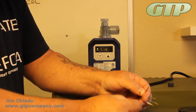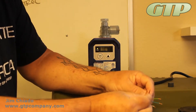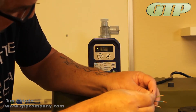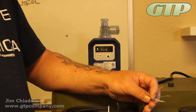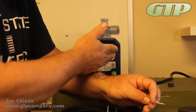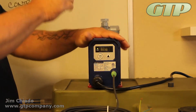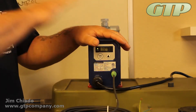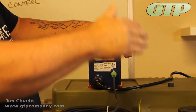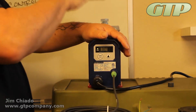The brown and the black are the pulse inputs — I've got to switch it back over. You can see it starts displaying numbers, and what it's trying to show you is the average strokes per minute based on the signal coming in. It's really irrelevant, but if you're looking at it and it's at around 180, you know you're getting about half the output. This pump only has speed control adjustable, so the stroke is always 100%. It can't slow it down — if you get one stroke every minute you get one globule of chemical a minute; every pulse takes a full stroke.